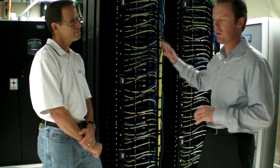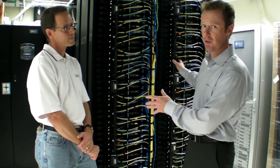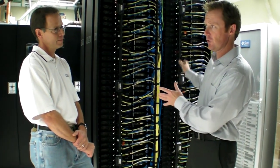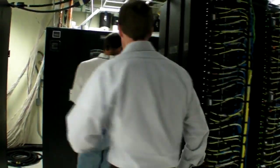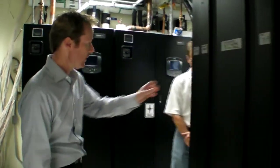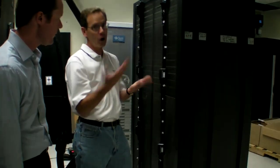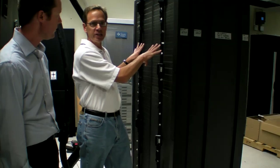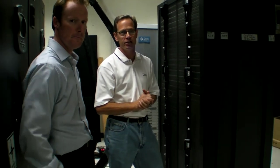Back to the dimensions — you mentioned the rear door heat exchanger as being optional. Yes, it obviously looks like an integrated piece of this solution, but that's a really interesting point. Let's go to the back and take a look at it. What Ken's talking about is just this narrow portion of the rack — the entire heat exchanger is in about a 4-inch depth. In this 4-inch depth, we can take away 100% of the heat or more for all configurations that can go into this rack under all expected room operating conditions.